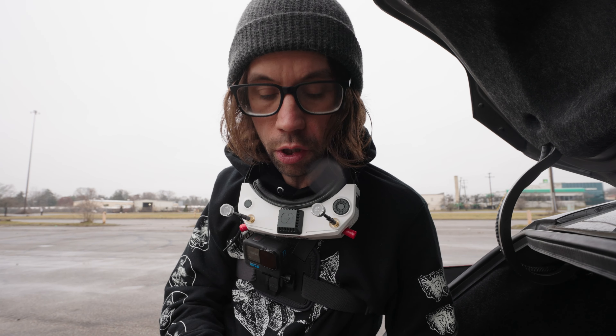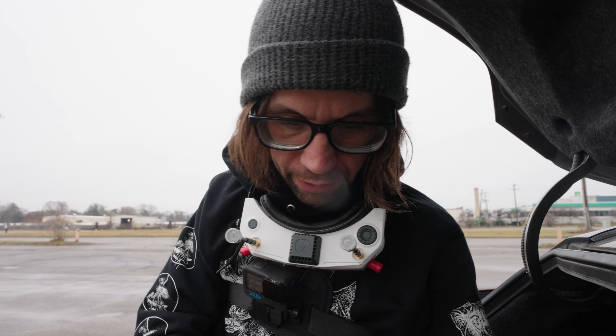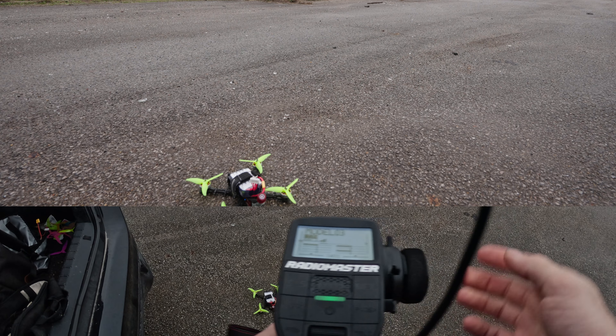It bound to the drone just like that — because of the passphrase. That's the magic of ELRS. All you need is to flash a passphrase on every receiver and all your radios will just sync up and bind immediately.